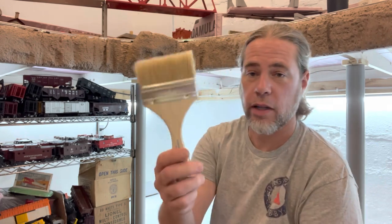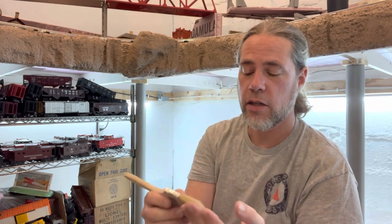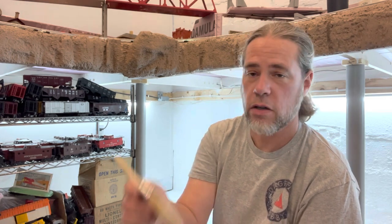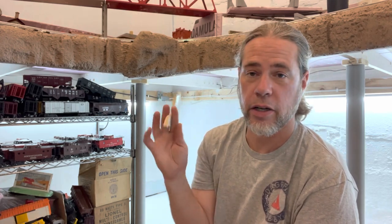I've used different types of brushes and rollers for this sort of application, but with the rough concrete and the thick paint, a good brush really does the job. I'm not sure if these qualify as good brushes — this was an Amazon purchase, a box of 12 four-inch chip brushes. They were cheap. What I like about these is that the bristles are short. When you have a really long bristle brush, the paint just ends up filling the whole brush and it wastes the paint. With these, short bristles make it easy to apply, easy to get into little cracks and crevices, and when I'm done, it goes in the garbage instead of trying to keep it alive for the next six months.